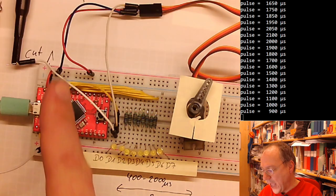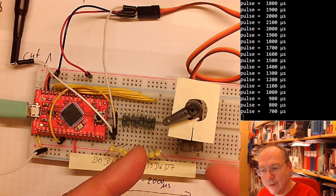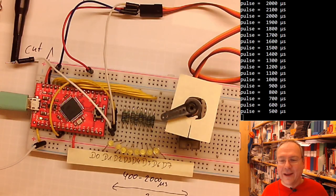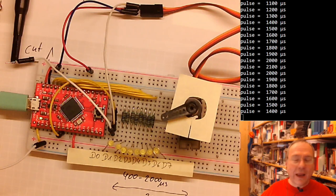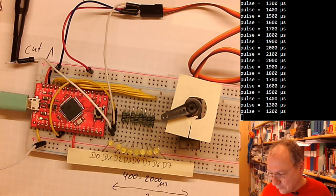And if it does, unplug the power, turn it by hand, and it overturned again. Okay. Don't know. Don't want to go there. Yeah, exactly. Imagine car wipers getting stuck. So actually, yeah, it happens. Go to 2000 and no further. That should be safe for your motors. And then you don't get the problem of a stuck motor.